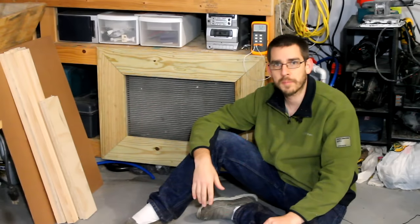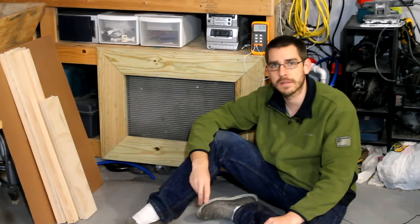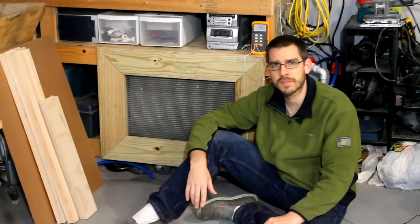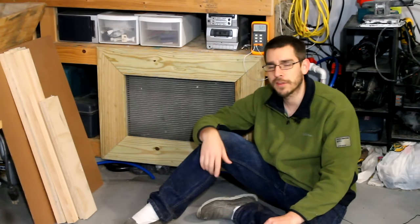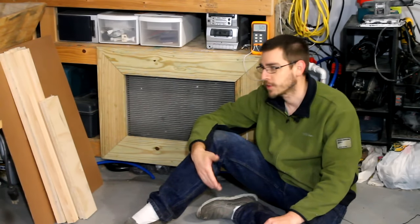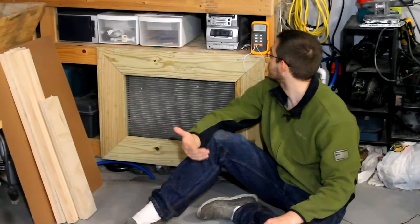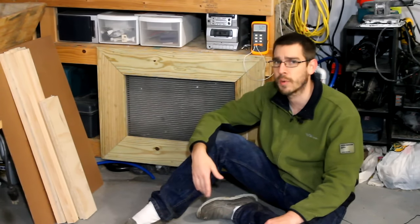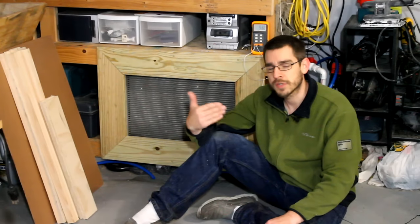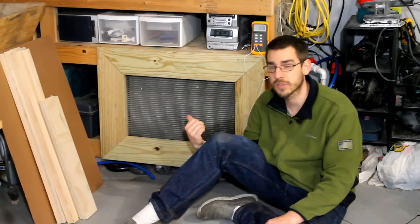Well, I'm just about finished up in here. I was working on some other things, aquaponics lights and things like that, out here. I've been out here for about 2 hours, maybe 2 hours, 15 minutes or so. I did hit the thermal overload on the pump, and it shut off for about half an hour, so I didn't really get an accurate temperature. I was trying to see how hot I could get the garage, but it got up to about 55 a little while ago. It's down to about 53 now. I'm letting the fire die out, but I think with some minor improvements, a bigger fan in here, number one, would probably be the easiest solution.